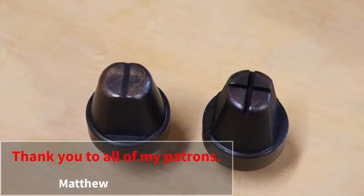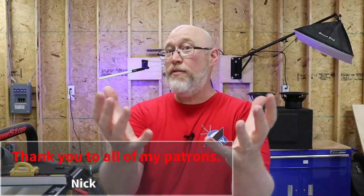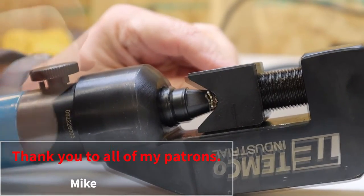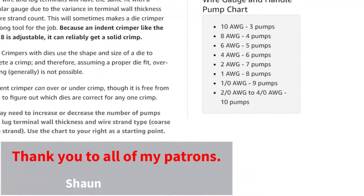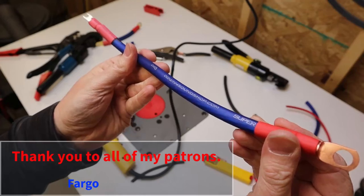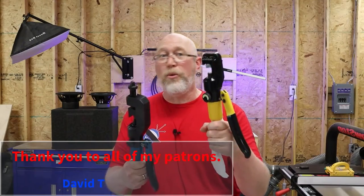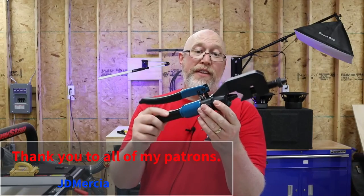So it's not a perfect tool and it does have some other downsides. There was no on or off label on the on/off dial. Second, it's only a five-ton crimper — but the question is whether five tons is enough, and the answer is probably yes: you just saw me try to pull wire out of a lug and the crimp held just fine. The manual includes a handy chart explaining how many pumps you need for various wire sizes, though in my experience I found you need a few more pumps than listed. It also didn't come with a carrying case, but that's probably okay because you don't have to keep up with all those dies. Is it a better tool than the cheap die-style crimper? Absolutely. It has a much higher price, but the Temco is the only one I could find with a spring-loaded handle, so I definitely think it's worth the extra money.